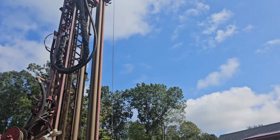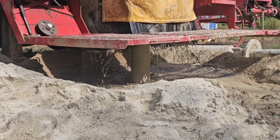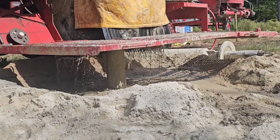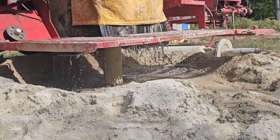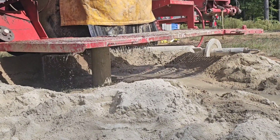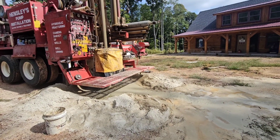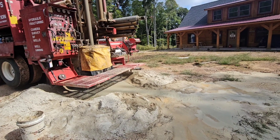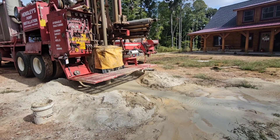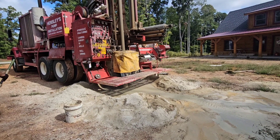We are currently at about 70 to 75 foot. When I was at 65 foot, I encountered rather large water — looks like maybe 6 to 8 gallons per minute. It was discolored and looks like it maybe had sand in it or some other minerals that haven't come out as well. I pulled the well for about 10 minutes and it actually cleared up. So I'm going to make notes that if it needs to be lined in the future, we can line it at say 70 foot — it'll take that water out of the equation so they won't be dealing with the discoloration, but that also reduces the gallons per minute the well would make.